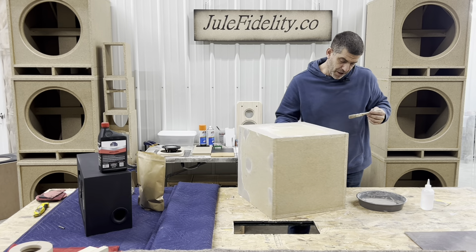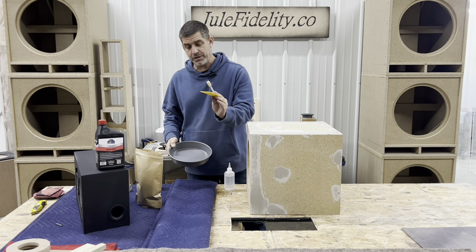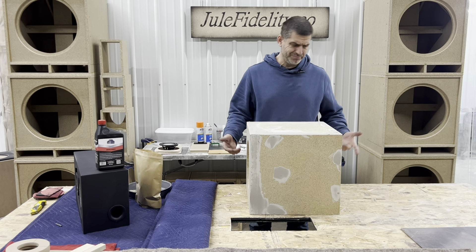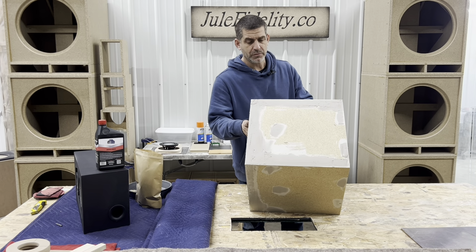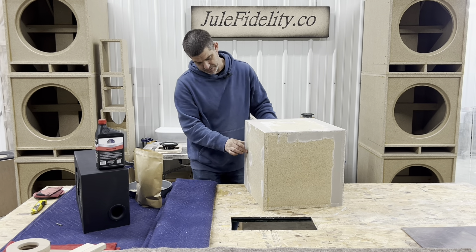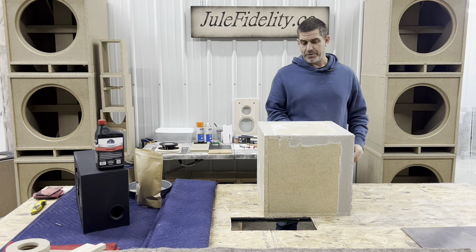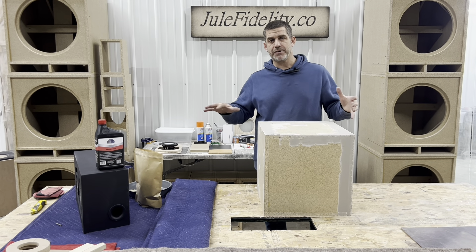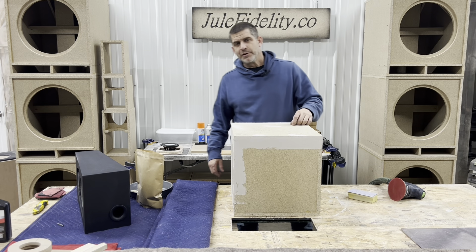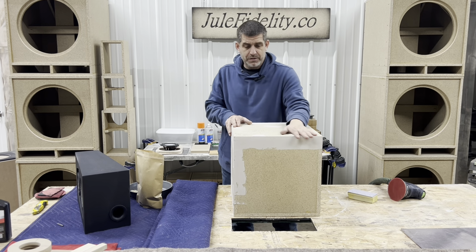It'll sand right off. You can already see this is drying — see how it turns a little more white from the gray? It's really starting to dry. You can put a fan on it and it'll be dry in a good hour. We've washed the pan out, washed the brush, and washed the spreader with water — it's only been about five minutes and it's drying pretty good. With water-based stuff you need air movement across it, not heat — air movement pulls the moisture out of it.